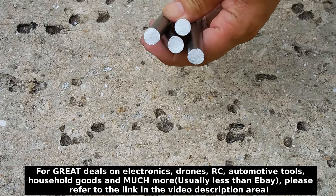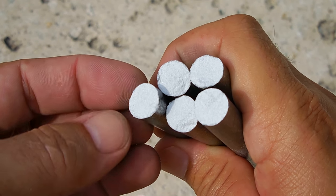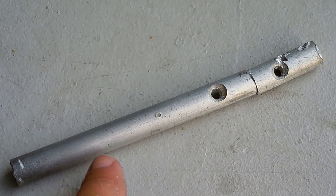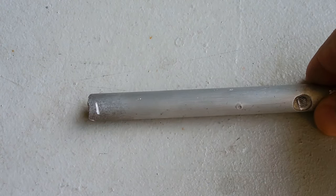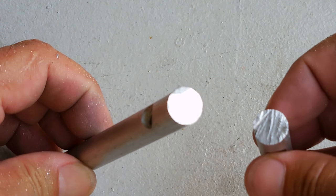Putting them all together for you like this — they are no longer that shiny aluminum color, and you can see it's very, very grainy and extremely brittle. The entire aluminum rod soaked up all that gallium, with the exception of the last five inches. Over here you can see where it ended with the corrosion, which may have made its way all the way to the end if I had waited a few more days. You can see where I cut into it — it's actually white powder — and the very end here was unaffected.